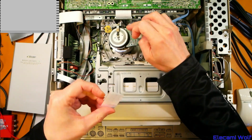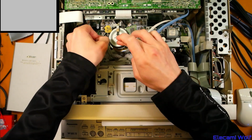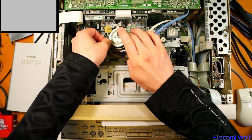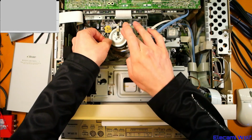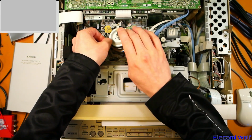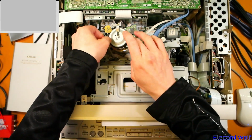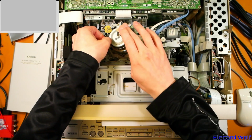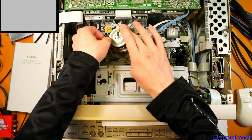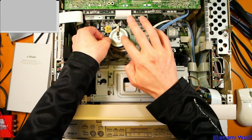What it looks like it does is record the two luminance tracks reasonably distanced from themselves, and then put the chrominance data at a different angle right next to the luminance tracks. Kind of like how the hi-fi sound gets put into the video, but at a deeper level, at a different angle. I think that's what happens with the chrominance data in this W-VHS system.